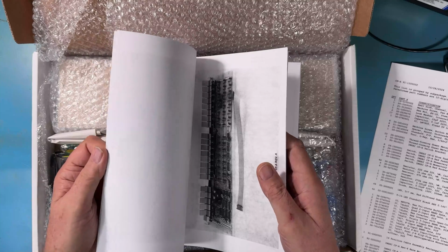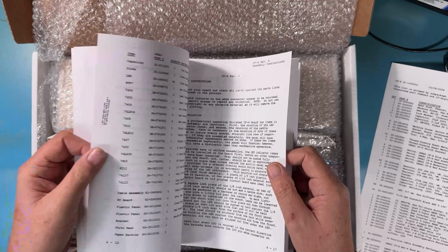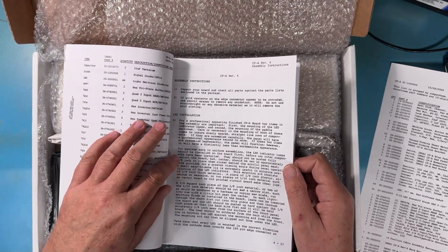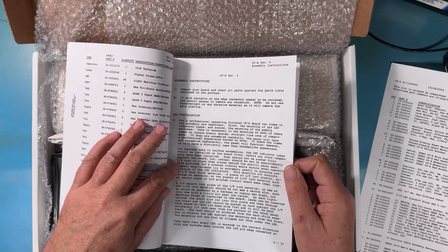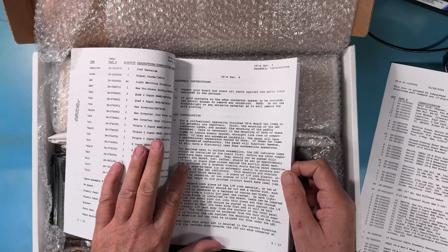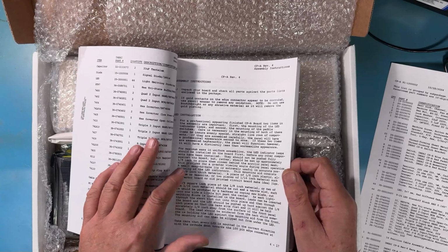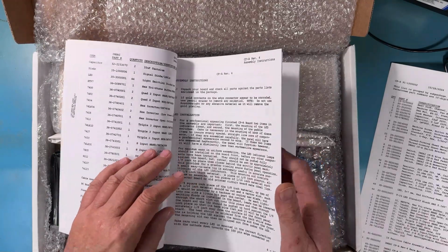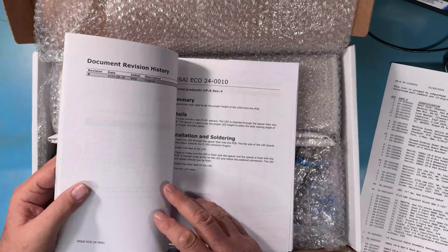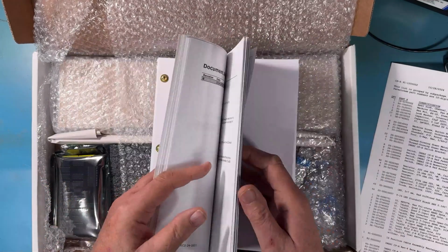If you actually read the LED details in here in the assembly process, it talks about getting a professional look. They're installed on the board first before any other components, and so on. And then it talks about making a jig to hold them the right height up off the board, about 1/8 of an inch. And it says, take a couple of blank pieces of PCB, glue them together, hacksaw a slot into it, and use it as a spacer. Those instructions we're not going to do because we have spacers, and this just says instead use the spacers and hold everything down flush.